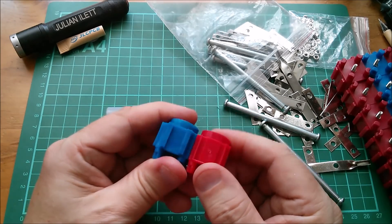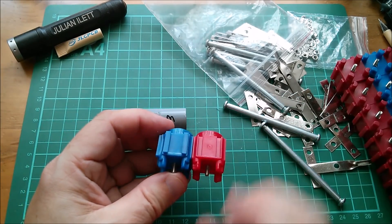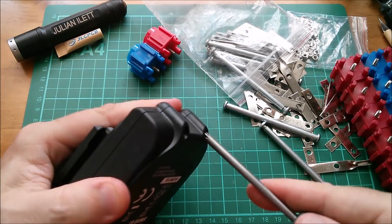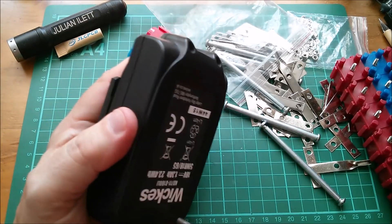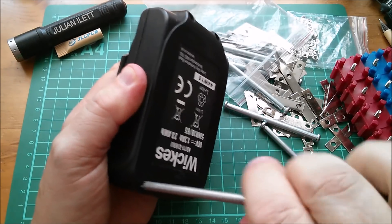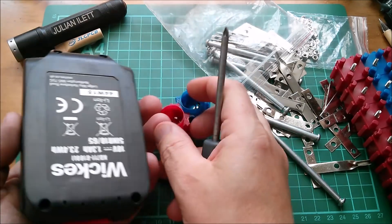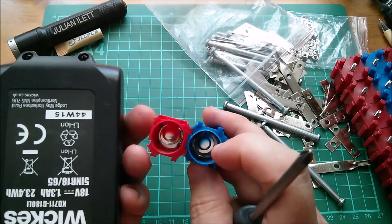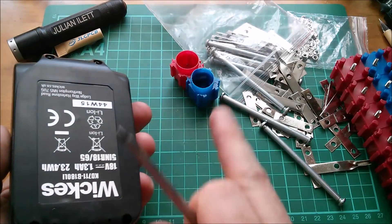For my first battery pack, I'm going to use just four cells. I'm going to take four of the five cells out of this 18-volt battery pack. It's occurred to me that these cells are going to be welded together with nickel strips — I'm going to have to pull those strips off, but that might leave little tiny pips on top of the connector. That wouldn't be an ideal surface to mate with this spring-loaded flat button connector. So it might be necessary to grind away any excess metal to try and smooth it down.